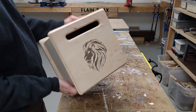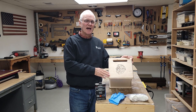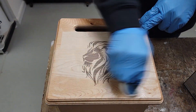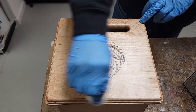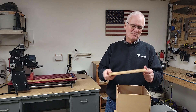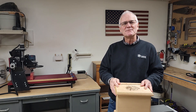We're all good. Conveniently, we can make the box lid tighter or looser just by raising or lowering those screws just a bit. The box is fully assembled now with the lion inlay up on top. I've got some cotton strips, some nitrile gloves, and some wipe-on polyurethane, and we'll be putting the finish on the box. Finishing is not normally my favorite activity, but I do like to see how the walnut pops against the maple when we put this wipe-on polyurethane finish on. The Lions Club donation box project is now pretty much complete — we can make some donations in the donation slot, rotate off the box lid, retrieve the stuff we put in the box, get the lid oriented, twist it a little bit, and lock it in place. That worked out pretty well — the whole twist-on, twist-off idea.